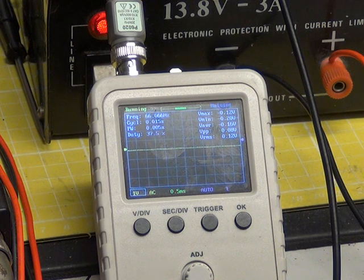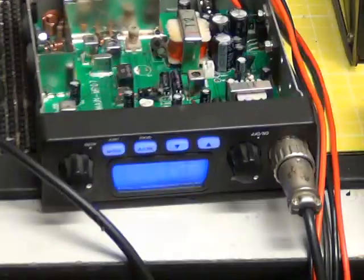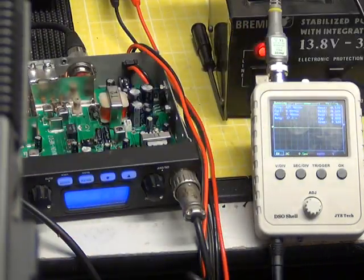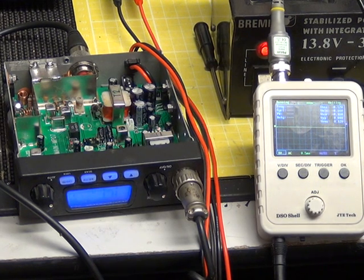So there we are — we've set the receiver by tuning the radio into AM, which can only be done with the new multi-standard type of sets, and then gone into FM and used this cheap little Alba hand portable with the call tone to set the FM detector. That's a very nifty way of setting up a CB radio with about 120 quid worth of equipment, without needing a £10,000 test set. In the next video we're going to do an old type of CB radio — FM only, something like a York 861 — and again use the shoestring equipment to set it up. I hope that's been helpful and useful; thank you for watching.